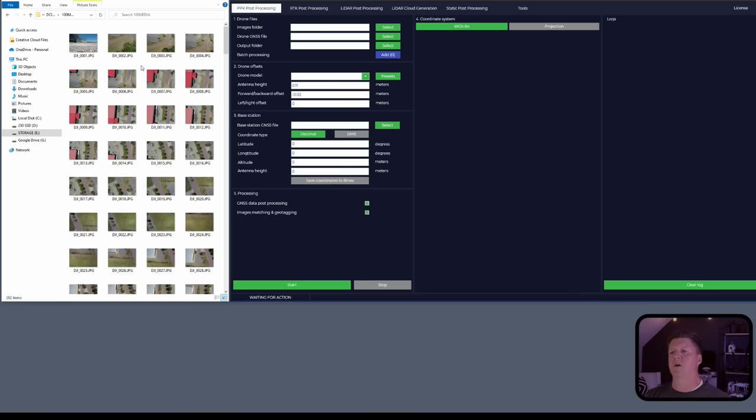And just so you know, I followed the recommended protocol that TopoDrone gives you in a training video that anybody can watch. I took the Mavic 2 Pro up to 200 feet, because that's what I was going to fly the mission at. At 200 feet, I did autofocus, then changed it to manual focus. I then set my exposure manually to be exactly what it needed to be. And then I ran this in DroneDeploy, and I set DroneDeploy to use the DJI settings. So in other words, I did not want DroneDeploy to override that.